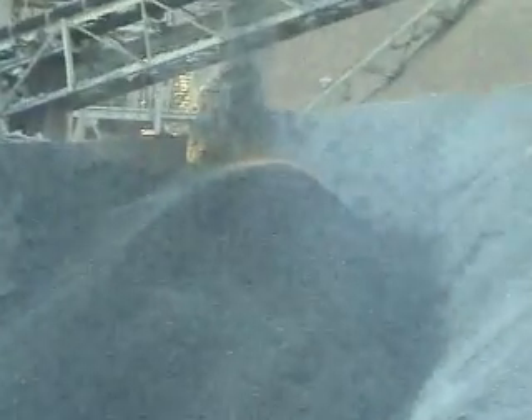This is a shot of our screen deck. Today we use polyurethane screens to separate our rock. This is a shot of the dry side with the overs going back to regrind. Between this deck and the one below we make our inch and a half rock. From the middle deck to the bottom deck we make three-quarter inch rock, and then the material is conveyed to a second tower where we make our road screenings. And here we see the final product being stockpiled.